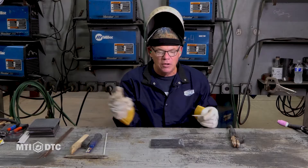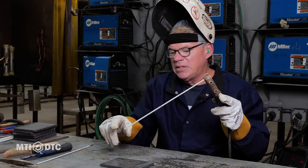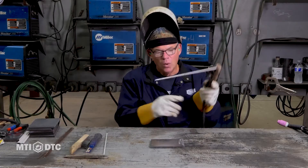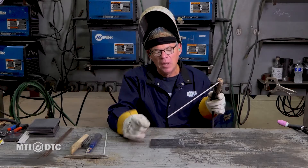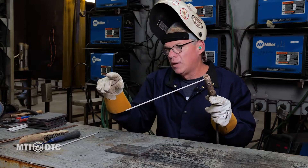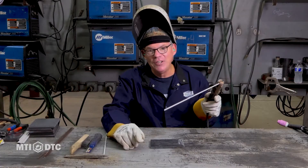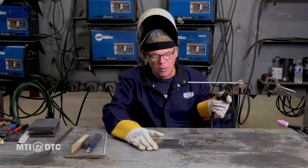This is coming off the positive side of our welder, and I told you it was reverse polarity. What that means is the flow of electricity is actually coming out of this steel up into the rod. Let me say that again — this is on the positive side of the welder. The electricity is actually flowing backwards in our head; it's reverse polarity. It means the current is coming out of our base metal up through our welding rod and melting it. What that does is it helps with the penetration. I can run on straight polarity, but it's going to sound odd and it's not going to penetrate. Always make sure your welder is set up so this is positive. Our whole table here is on the negative — it's grounded. So it's on the negative side.